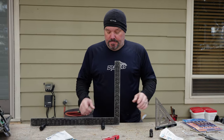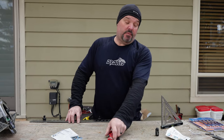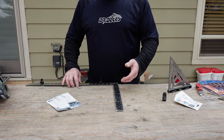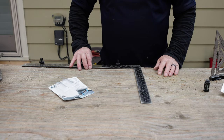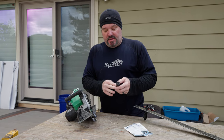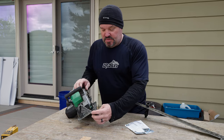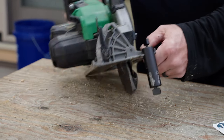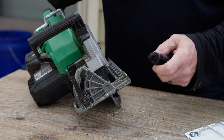Also, if you're using it on conventional lumber — let's say you got a two by 12, or you're marking wide boards, two by 10, two by 12, and you don't have a large speed square — you could use something like this to keep things nice and square as well. You can do the same thing with this product too. Maybe you're ripping a little bit thicker material and you want a little bit deeper support. You can take this and lock it down onto your fence, and it becomes a rip gauge for your skill saw or framing saw.